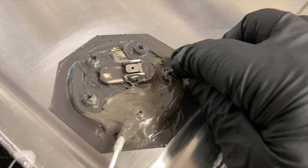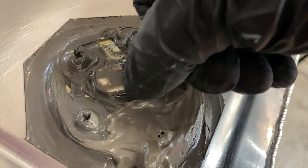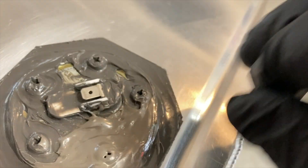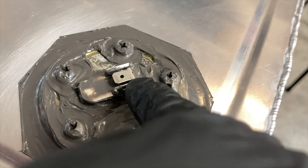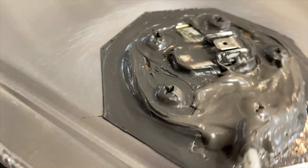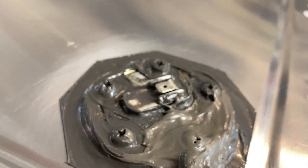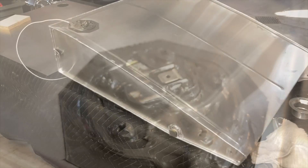I taped this off — I believe in coating the whole thing, not just making it look pretty. I also packed the positive connector all the way around after it was clean and dry, because that penetrates down through that piece of plastic. That would be one of the main leak points in this plastic. Then we go all the way around the plastic and inside of it, then pull the tape off and the connector slides right on — just don't get too much underneath it because you need room for the connector and the insulator.